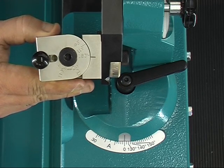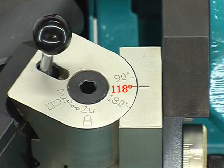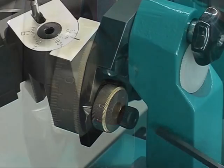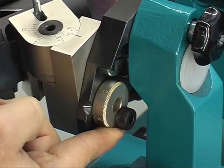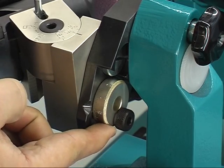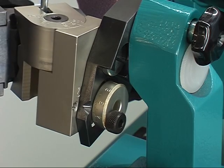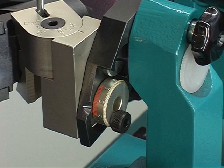The point angle can be adjusted on the main scale or on the index stripe as requested. The clearance angle can be chosen freely depending on the material to be drilled. The normal range for a spiral drill is between 4.5 and 2 — the higher number means more and the lower number means less clearance angle.